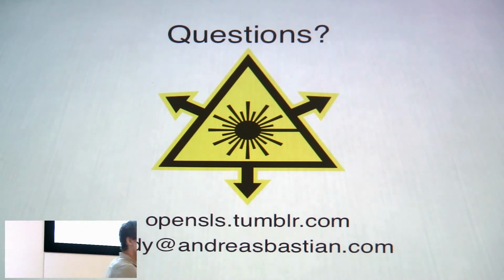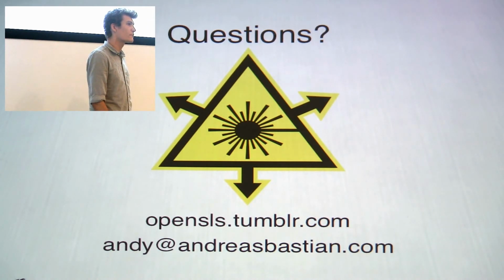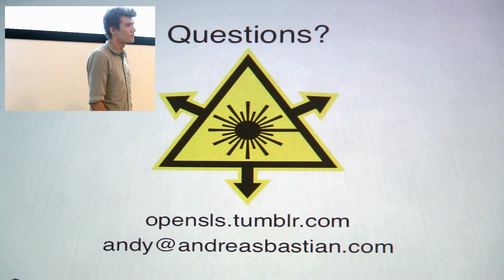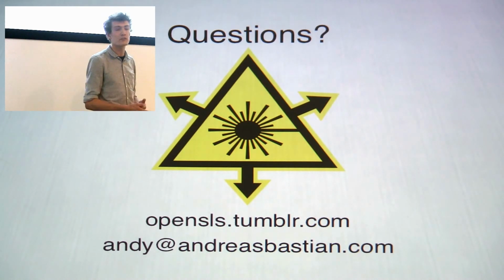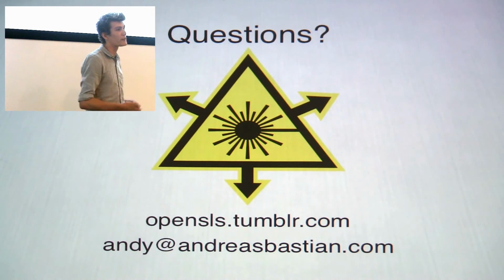So I know in Jordan's previous work, you would use sugar and coat it in hydrogel and then melt away the sugar. So would your laser sintering technology be compatible with that? Because it seems like the final product doesn't seem dissolvable. I guess the final product will be dissolvable because we're actually going to be sintering sugars. So we're using just very finely ground sugar glasses, the same material that Jordan's worked with in the past, but we're fusing it and forming it in a new way. So it should be compatible with the hydrogel casting process.